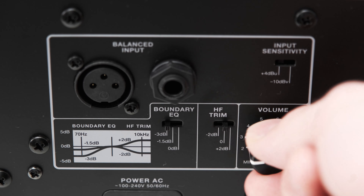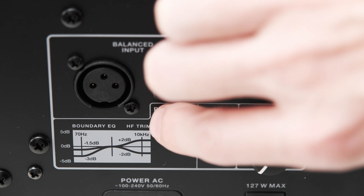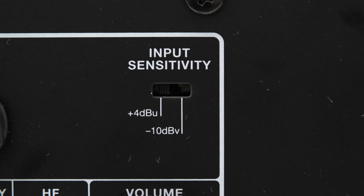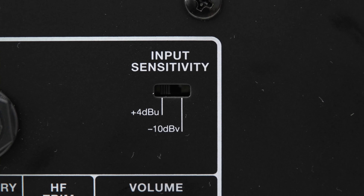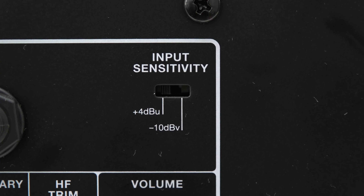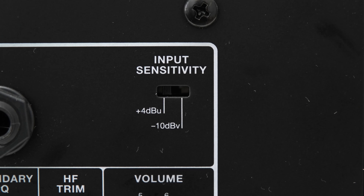Because this is going to be an unbalanced connection, the quarter-inch jack should be TS in this case. It is okay to go with an unbalanced connector into a balanced input — it just won't be a balanced connection, but it still works fine. You need to take a bit more care when plugging an unbalanced TS jack into a balanced output on an audio interface, as it shorts one side of the output to ground. Please consult the manual of your audio interface to check if it can handle that — many audio interfaces can.